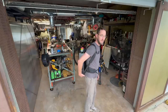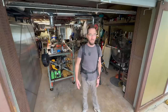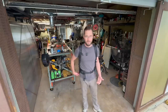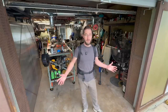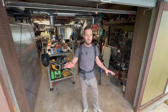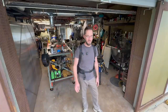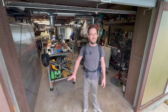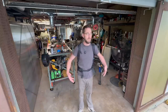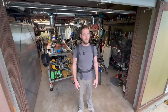I got this machine in used condition to save money, so it has some dings, dents, and scratches. It does not have a battery, but it does come with a battery option — a 48-volt battery — and it can be powered fully by battery with no cord at all. So if portability is your goal and small jobs with very irregular surfaces is what you're doing, this machine is probably for you. If you're going for big surface areas, you should probably get a continuous wave laser — it'll cost a little more and be bigger and heavier, but the higher power output will be worth it.